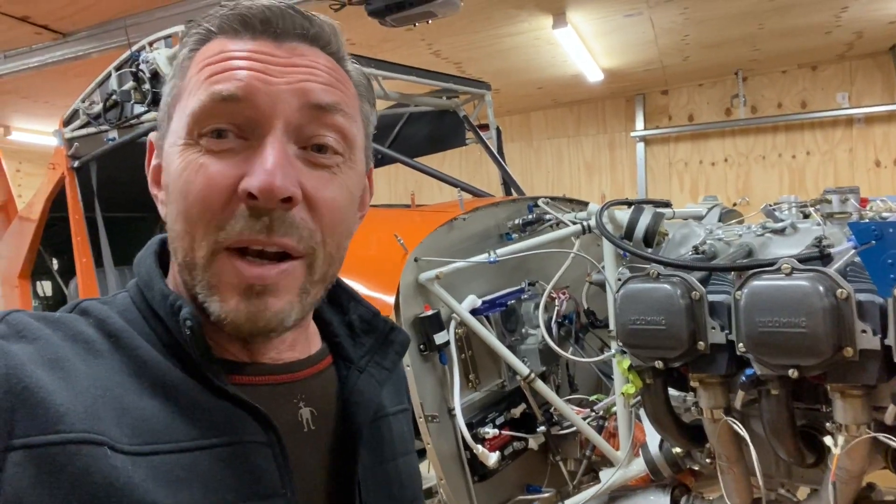One of the major projects of the last month has been the avionics and engine wiring, and I enlisted some help. Kelly from Canterbury Avionics spent three days with me here working on the Bearhawk and I was very glad to have his help. I'm now just finalizing all the wiring — it's all in place, all the lugs are crimped on, everything's up and running and being tested. We turned the radios on, did some practice VHF transmissions, and everything's working and tuning up properly. The Dynon screens were already working and all the avionics was in the rack about six weeks ago, but it was all the probes and transducers that needed to be wired in properly.